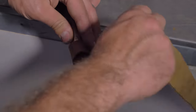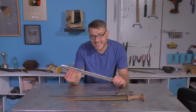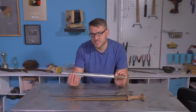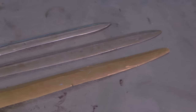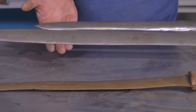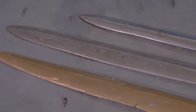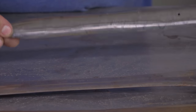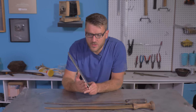After quite a bit of grinding, I now have a polished-up sword. This ended up being probably the hardest thing I've had to cut and grind — so the cast iron is actually pretty promising in terms of hardness. But I think that hardness is going to be the issue, because it comes with a lot of brittleness. I was really surprised how shiny and steel-ish it looks — it looks almost exactly the same as the forged iron sword. The chemical composition is going to be a lot different, but visually they look pretty much the same. It's a pretty thick sword compared to the others, partially because we cast it thick, and also because I don't expect it to be too strong — so the thicker the better.